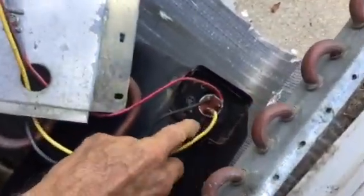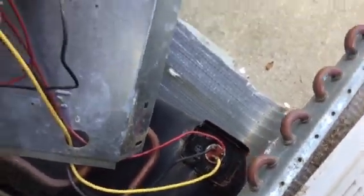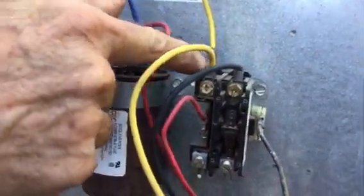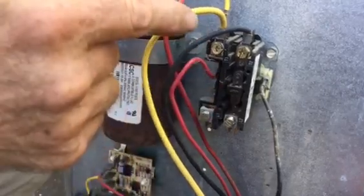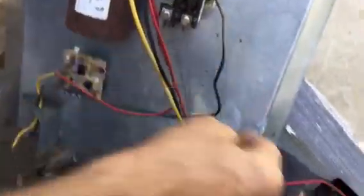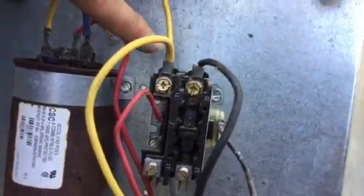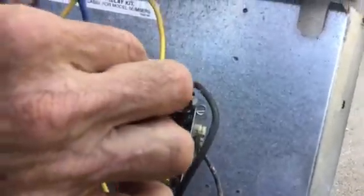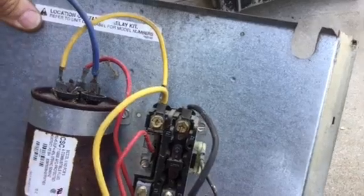This wire here is the run of the compressor, and it's going to go to T1. A lot of times, if you'll notice on your contactors, you'll have yellow wires, blue wires, your other color wires — usually on T1. And the black wire here is common. Usually all the same color wires — all the black wires — will be on one side, and all the other different color wires will be on the other side. They do that just to keep you organized so you don't cross the wires, because if you put the wrong wire in the wrong spot, it would either burn something up in the compressor or just wouldn't work at all.